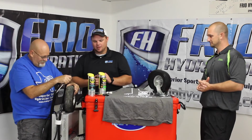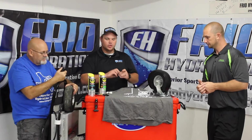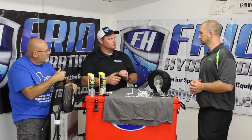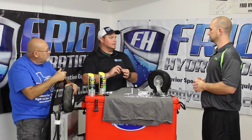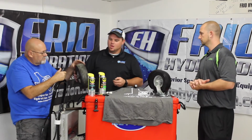But then if I need to replace the bearings, it's because they're worn out, because maybe I didn't grease them. So how am I going to grease those bearings? Well, what's the number one reason bearings go out? No grease. Metal to metal is bad. You need your grease in there, okay? So when your bearings go dry, this is something we all too often forget. Your bearings go dry, that's metal to metal, it gets sand, grit, whatever. It's just going to begin breaking down these bearings. So once these bearings are broken down, they're worthless.